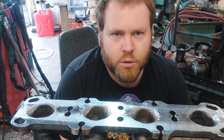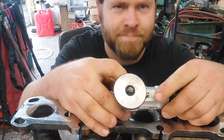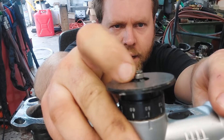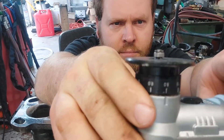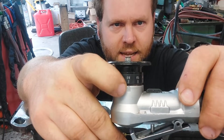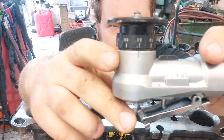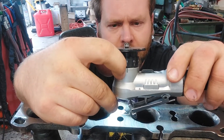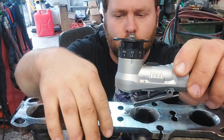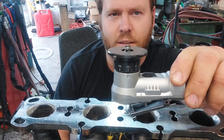First thing I will usually do is set myself up with a couple of tools. This tool here has two tungsten carbide inserts in it, and it chamfers at 45 degrees. On the side of it is the adjuster. I've calibrated it so that what it reads is fairly correct. For most outside edges I'm using 0.5, and then the insides if they need it I'm going up to 1.2 to 1.5. So at the moment this is preset to 0.5 and I'm going to do all these outside edges and all these holes. Apologies, this is going to be a little bit noisy, but it is quite satisfying.